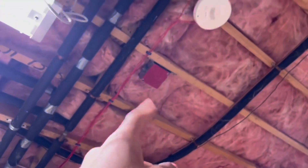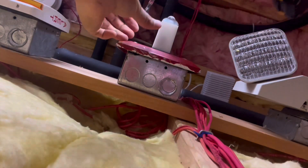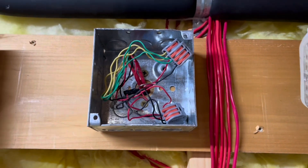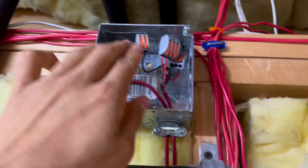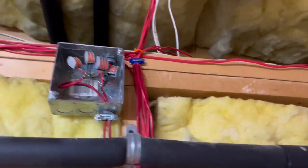We'll start by removing the wire guard, then remove the horn strobe. This looks really messy, but I'll briefly explain how it works. This is the speaker output — I ran a wire from this box to this box, so this ties into that. You can see I've gone ahead and wago'd it up, so this runs up to that. And then same thing with the strobe wire. Now I'm going to cover up both boxes and then install the speaker strobe right there.